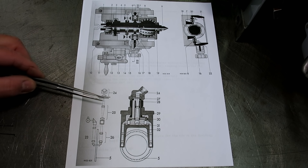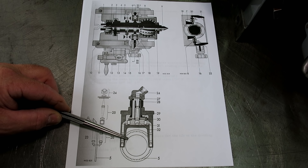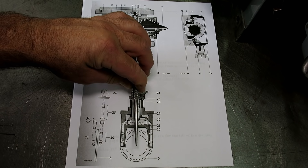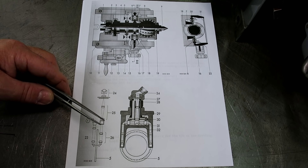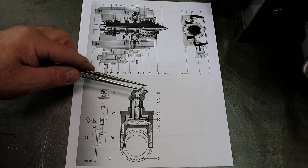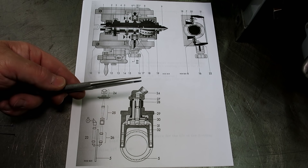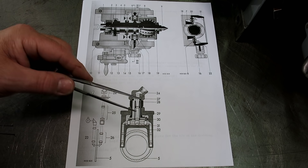Here's the optical diagram showing the scale we're looking at. The way the optics work is it looks at both sides of the scale at the same time — there's a split in the optical system so you align the two halves together. This increases accuracy and cancels out any eccentricities in the optical scale since you're viewing both sides. There are also problems in this area — when I look through the eyepiece I can see the coarse scale but not the fine scale that divides it into seconds. There's some crud, mud, rust, or corrosion on parts of the optical system that we'll try to address.